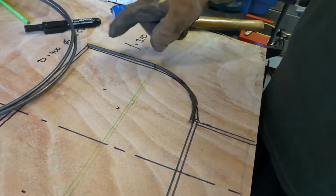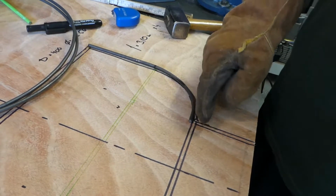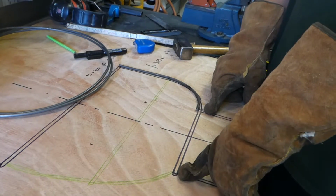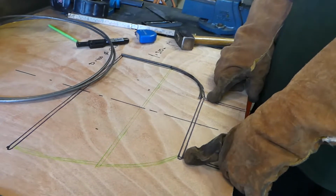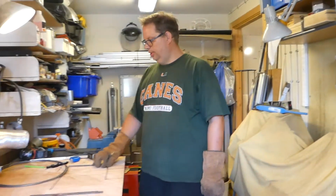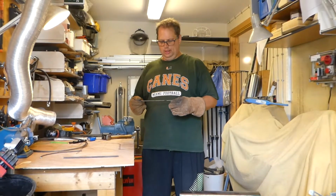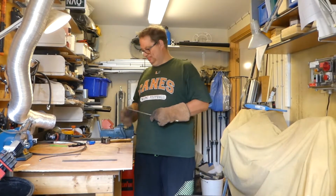When I have all four circles round and so on, I'm gonna weld the circles in place and then start finessing these so they end up on my stand, so to speak. I'm not 100% sure, I aimed at 200mm, I measured the diameter, it was 210, and it's probably not a 100% perfect circle. So it's going to need some finessing to get it in place, but so far so good. I have one done, 3 to go. So I just continue with this one, and we come back when I start welding the basket together. See you then. Bye bye.